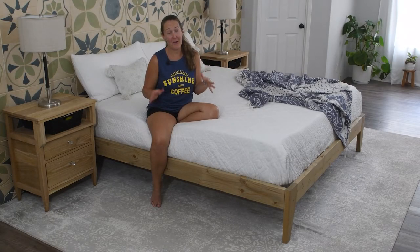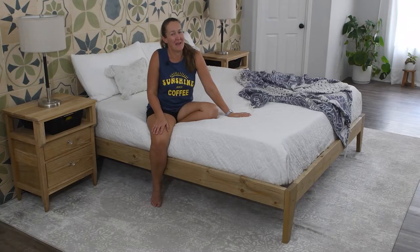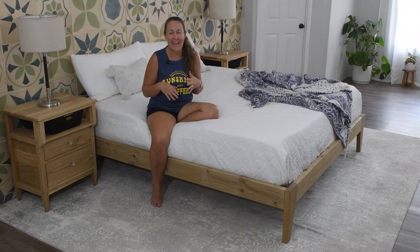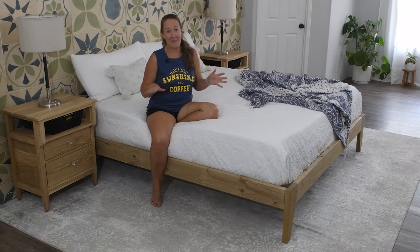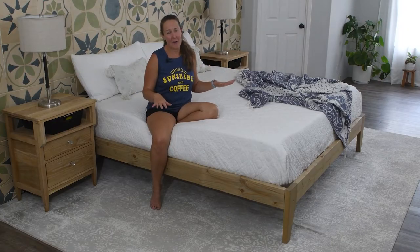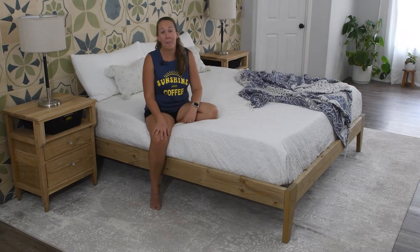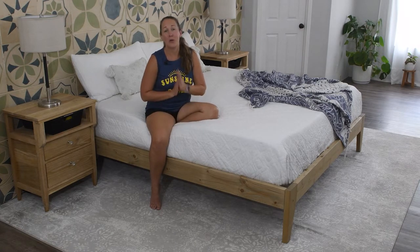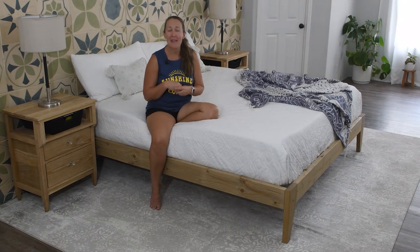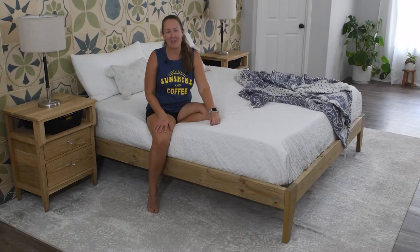I think it's official — I'm a real adult now. I finally upgraded to a king-size bed and it feels amazing. But if you're like me and you got approval to order the bigger mattress, hurried up and did it, and then it arrived and you realized you hadn't thought about what to put it on, this is the perfect video for you. So while my mattress sat in the corner for a few days, I built this super simple platform bed frame. It goes together really fast — you can do it in an afternoon with the Kreg Pocket Hole Jig. I used the Kreg 520, which is a great jig for small spaces or for working with long boards.